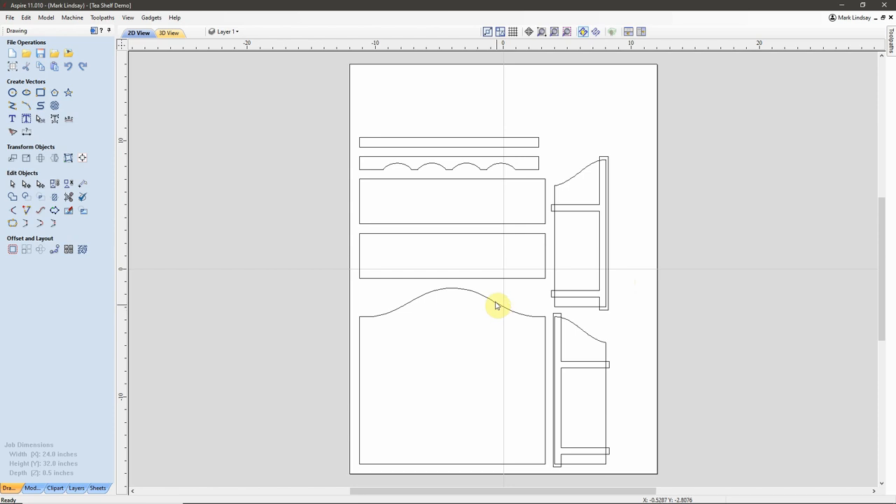I'm going to be leaving this back on this sheet and I'll change the dimensions of the material to reflect that. Normally what I do when I design a project is I will size the piece of material to be one inch larger than the vector outline size at a minimum. I like to go a little bit more if I have a piece of material big enough, but at the minimum, I want my piece of material to be one inch larger than the size of the vectors.